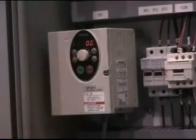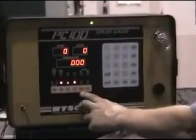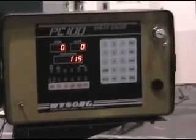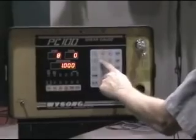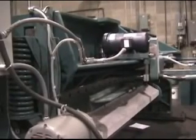For automating the Toshiba drive to the motor, put the PC100 in the manual mode by pressing INCH and METRIC at the same time. All the LED indicators should go out. Press STEP 85. The brake on the motor should release. Use caution moving the gauge. There are no travel limits in the manual mode.